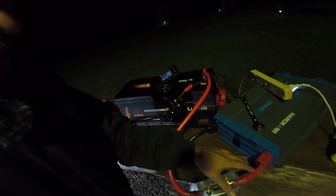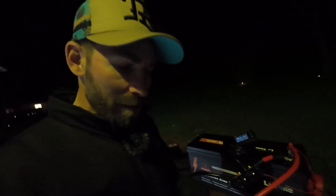Something really interesting: the battery stayed really cold while draining this much power continuously, right up until it got down to about 15 amp hours left — only then did it start to warm up, and even then it's not too bad. A word of warning though: if you're going to run air conditioning off your inverter, make sure you've got really thick cable. This cable is rated for 250 amps, but the insulation is actually melting from being continuously run for an hour. So definitely double check your cabling if you plan on running an aircon.